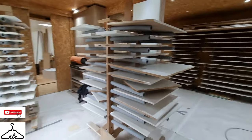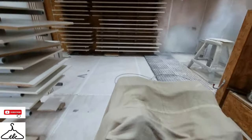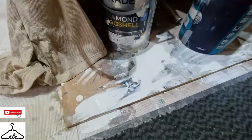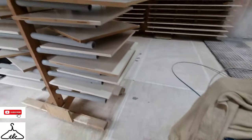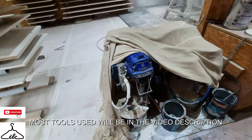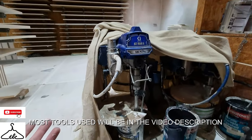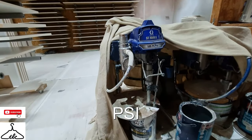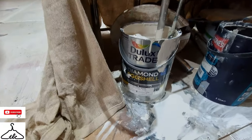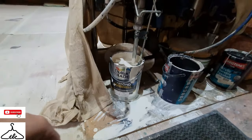So today's video is basically just to show you how far five litres stretches. I've got colour set up — it's like a creamy, very slightly off-white colour. I'm using a 595 PC Pro, Graco of course, spraying at around 12 to 1500 PSI — I think it's closer to 1500.